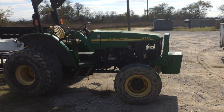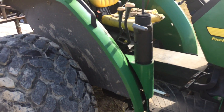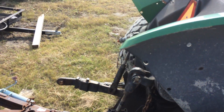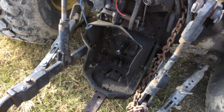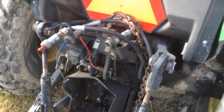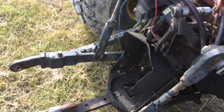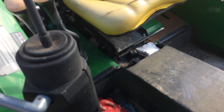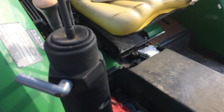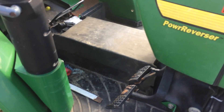The next piece of equipment is this John Deere 5220. The customer uses this tractor to mow rough areas on a golf course, but the PTO shaft has lost power — engine's not bogging but the mower is slowing down. I believe it's going to be a PTO clutch that's gone. We'll do a little more research before we tear it apart, but we'll have to split that tractor because the shaft goes all the way through it. We'll let you know what we find out.